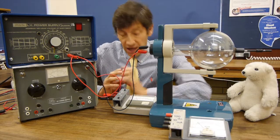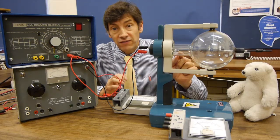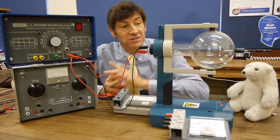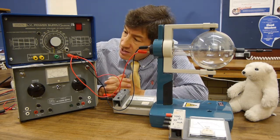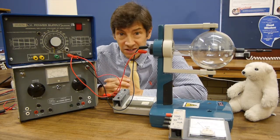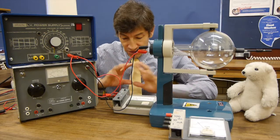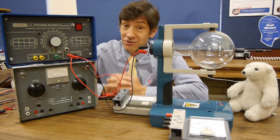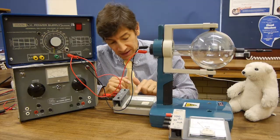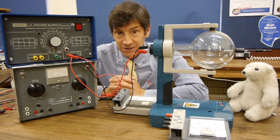The other reason for using a voltmeter is we're going to change the voltage on the filament. That'll have the effect of making the filament dimmer or brighter, and more importantly, cooler or hotter, so we can see how that affects the behavior of the tube. Normally you'd use 6.3 volts AC — it doesn't have to be DC. I'm using DC here only because the analog meter I've got is a DC voltmeter and it films well. What I want you to see is the voltage changing and how the current through the tube changes, and I keep an eye on this to make sure I don't burn out the filament.